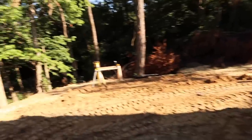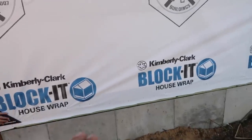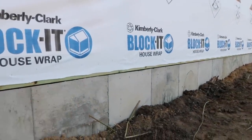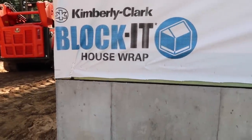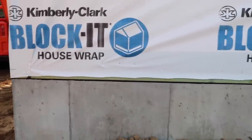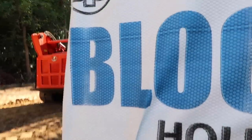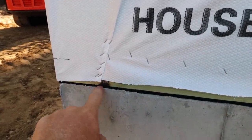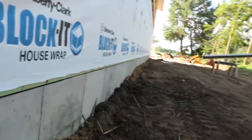House wrap is up. Now we've got to get our laser set up. The difference on a foundation wall versus a building with piers: with piers we set our grade board to a laser line, but with the foundation wall the best we can do is push the grade board down tight with that foam seal. That means we can't actually measure off of the grade board to find our dimension for our base trim. We'll set up the laser and use one of the marks on the inside of the post bracket that we marked when we first set up the building to determine a grade height off of this concrete corner. We'll set up our laser off of that mark so we can be consistent and accurate through the whole building.